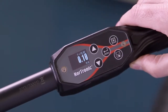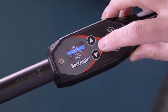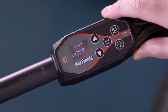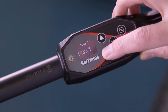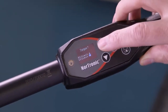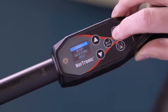What we now want to do is set our limits. We're going to work to plus or minus 4%. We navigate to limits — we're currently set to plus or minus 4%. To change the high limit we can scroll up or down. If we're happy, confirm. We then move automatically to low limits, where we can also adjust up or down. Confirm, then exit back to our main screen.